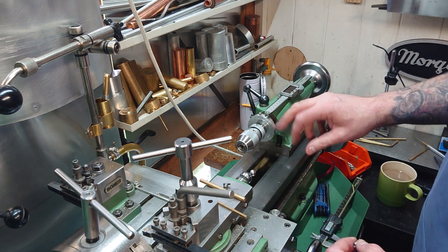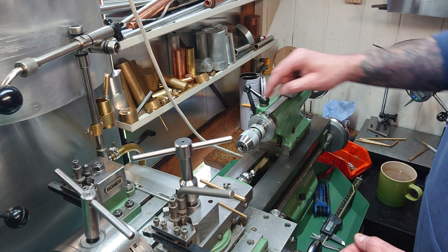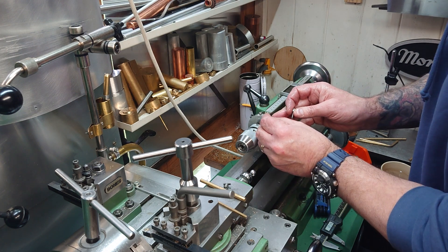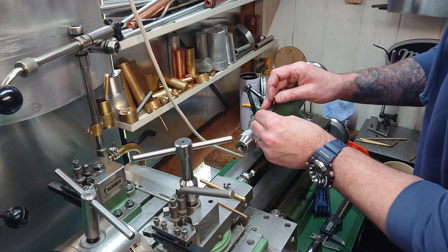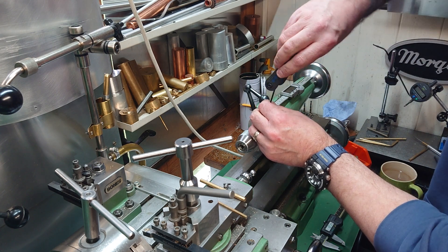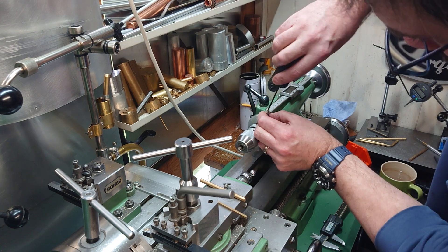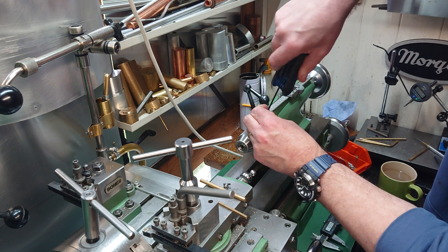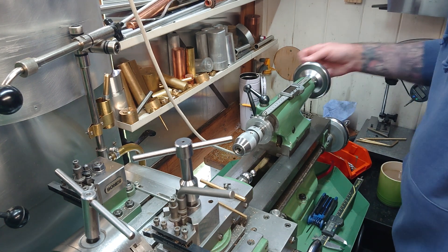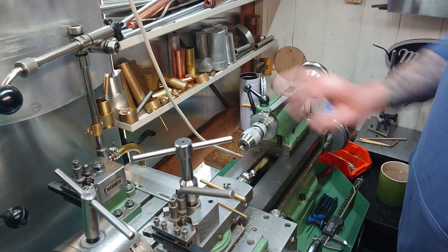So my micrometer slide on here, as you can see, is just on a piece of aluminium which is bored through and fits on the very end of the barrel, and taps with an M3. The end has a hole through it and I've chamfered some aluminium tubing just to fit that back on there in the correct position. Obviously the top one's at an angle as well so you have to make yourself a little collar for that. So there you go guys, hope you found that interesting or useful for a little half an hour project. Cheers guys, see you soon, have fun.